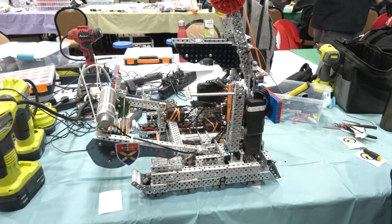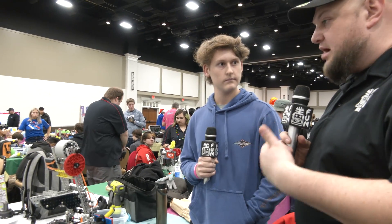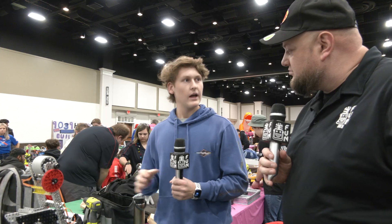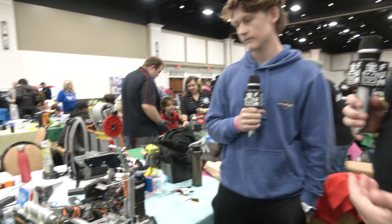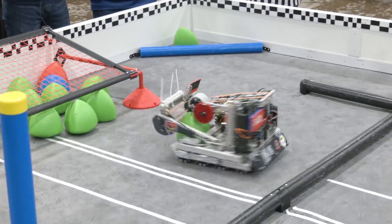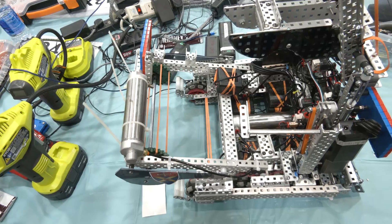You mentioned taking inspiration from 229B on their bot. Were there other teams you considered but didn't go with? Originally we had a four bar — we saw a raised four bar team and tried to build one, but it didn't work too well, so we scrapped it and went with a two bar. On the intake side, one underrated thing I love is really wide intakes on robots. Why was this design important to you, and how has it worked out in the field?